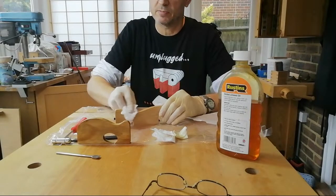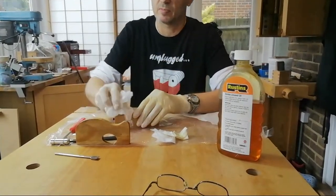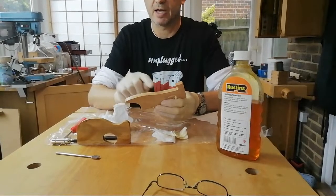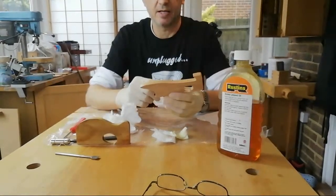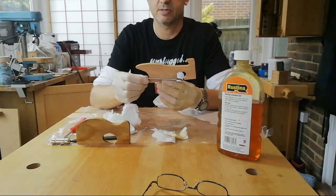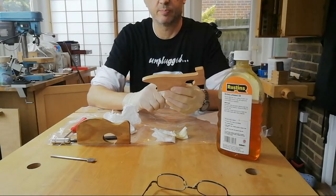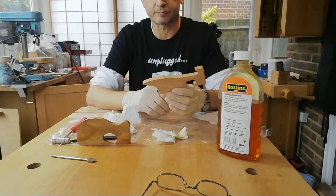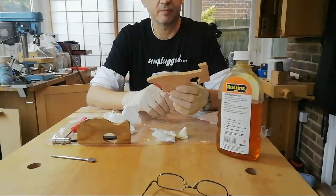I did think of different bed angles for the iron. Didn't really work with the dynamic look because I would have had an iron or wedge coming out the top. So I decided on bevel up and I put a 10 degree angle here, which kept the iron low enough that I could have the wedge coming out underneath the curve on the rear of the body itself. So far it seems to work okay — I haven't used it that much, I've tested it a few times. It works and it's comfortable. It's certainly very good in pine.